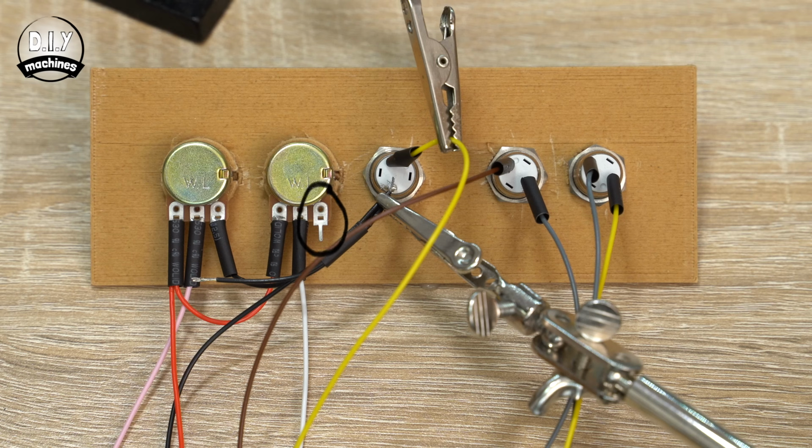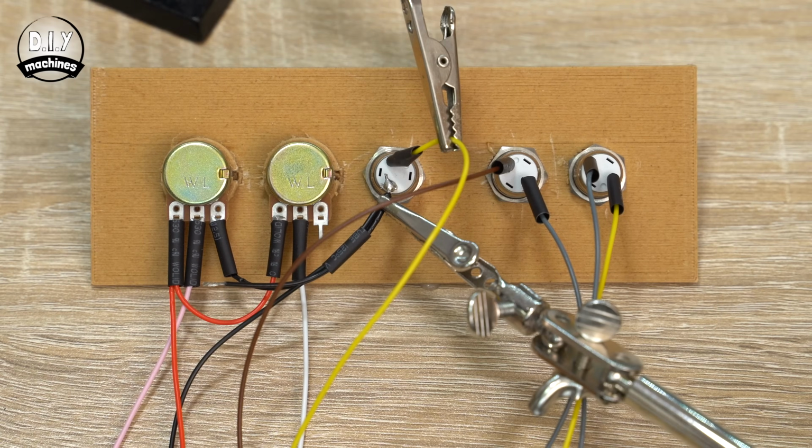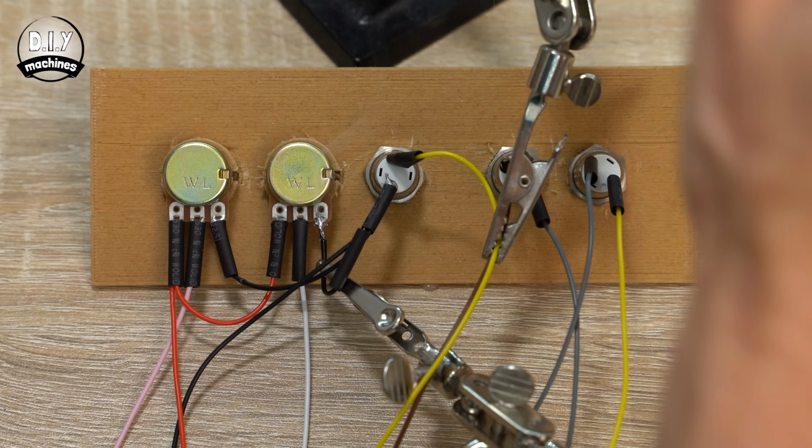Well, I got to the end of the control panel and realised I was trying so hard not to make a mistake that I completely missed connecting the sixth leg along. This is easy enough to remedy, and we'll add an additional wire now. Add a wire between the first button's leg, which already has two wires attached, and the unconnected sixth leg.